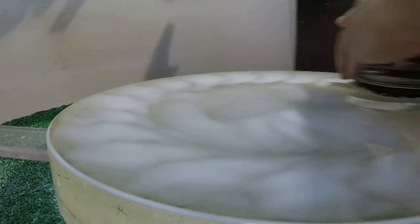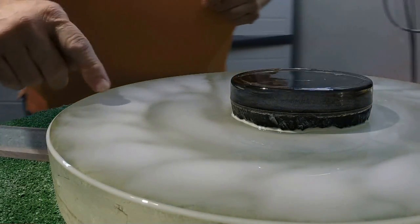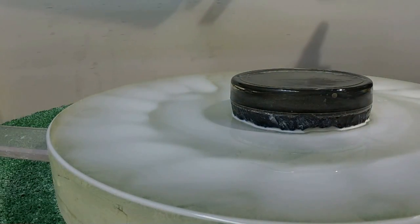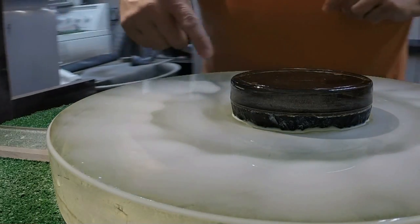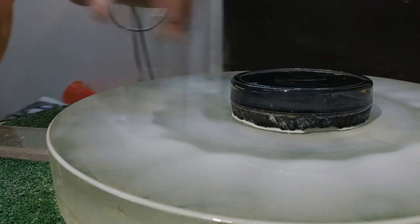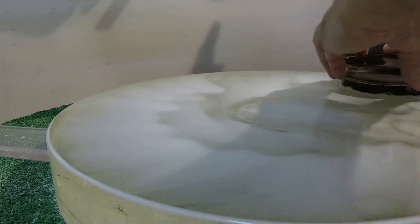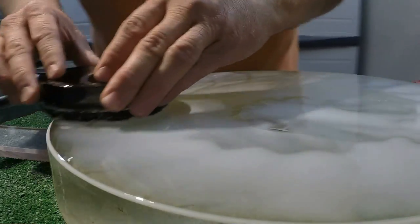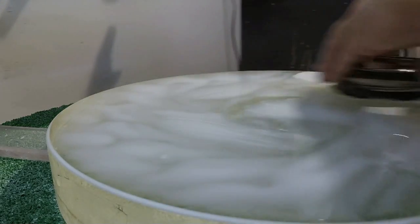You want to do just a little blending. Since I have a high area at about the six-inch mark and also a slight high area at about the four-inch mark, I'm going to use a combination stroke: I stroke first over the six-inch area for a few strokes, then run a stroke with the center of the polisher over the four-inch area. That works both zones and tends to average out your work marks. So I take about four strokes, then one toward the center — four, inside; four, inside — repeating that pattern.